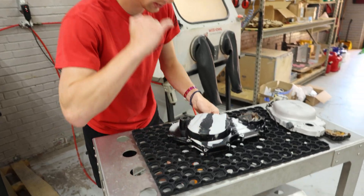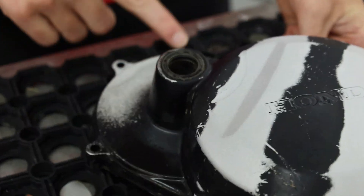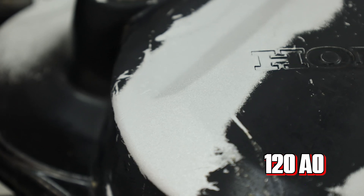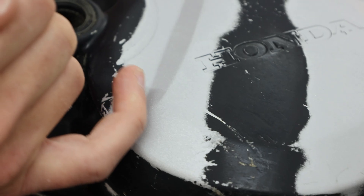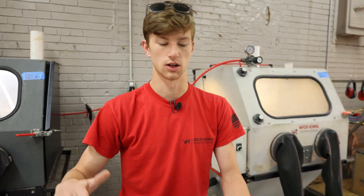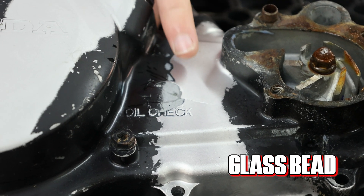And there is a quick example between these abrasives. If you look over here, this is crushed glass — it's very aggressive and it is perfect for removing paint, it absolutely rips when it comes to taking off paint. But it does leave a pretty unattractive surface, especially on aluminum, just because of how soft aluminum is as a metal — kind of what sandblast does; this is pretty much as close as you're going to get to normal sandblasting if you're using an aggressive media. Then we've got 120 aluminum oxide — you can see the glimmering in the light, this is a rougher finish, but this is perfect if you're trying to do any sort of powder coating afterwards. The 220 aluminum oxide gives you kind of a matte finish but the surface is actually a lot more smooth — good if you want to leave it this color but want a more matte, darker look. And then of course you've got the glass bead, which has been our champion for years because it creates such beautiful, incredibly smooth surfaces.